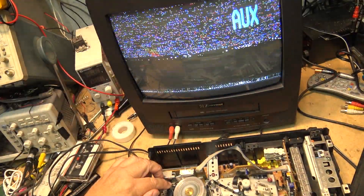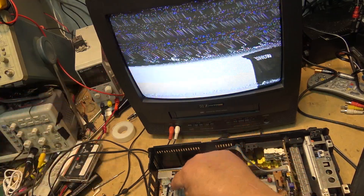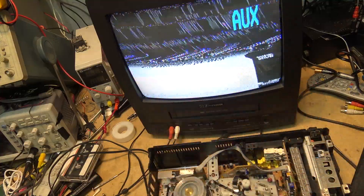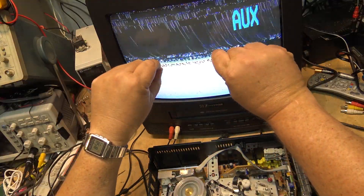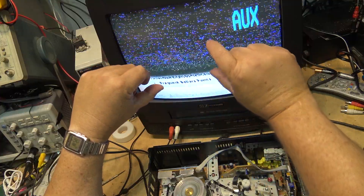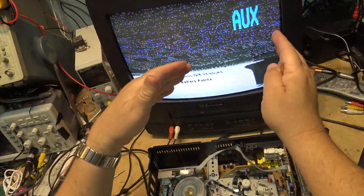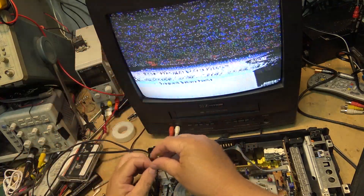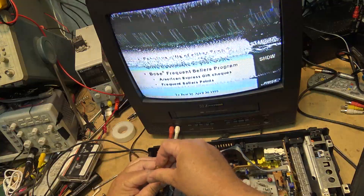When dealing with an analog television, remember that your picture starts at the top of the screen on one side and the bottom on the other. We can think of this like our envelope on a waveform monitor — we want to make the waveform flat. When we adjust one guide we're adjusting the left side of the picture; the other adjusts the right side. Think of it like turning the TV on its side. Here's our left-side guide, here's our right-side guide. Start very slowly turning the guide and watch the picture.